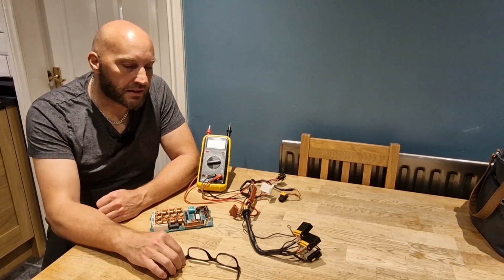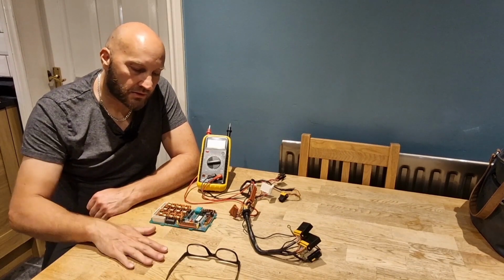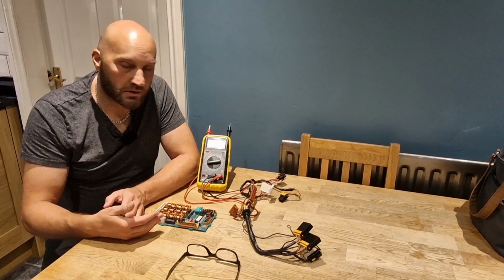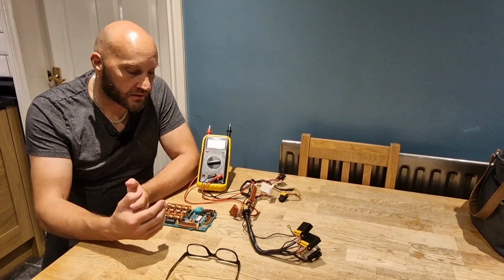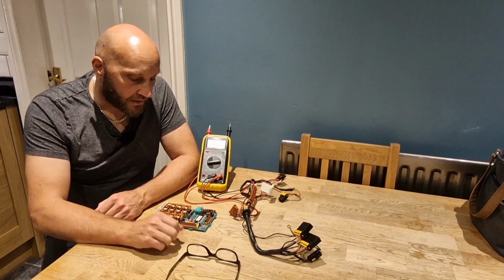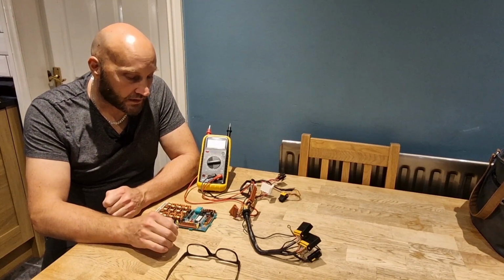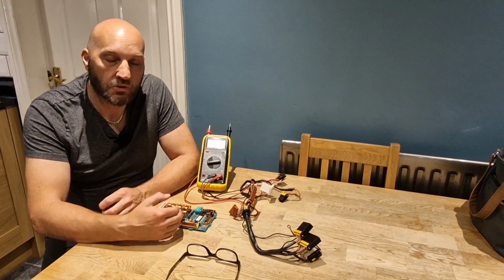And then secondly, I can use that working module by putting it side by side on the table here, and I can do some comparisons. I can do some continuity checks. I can do some resistance checks. I can check diodes, capacitors from a good board and compare it to this bad one. So that's the plan. I'm planning to take the ECU out of the working seat, swap it over, and then if it's working, bring it in here.